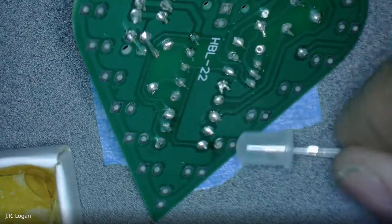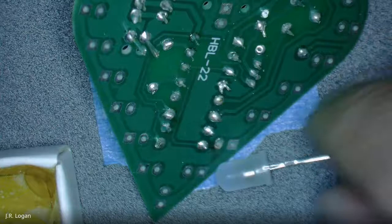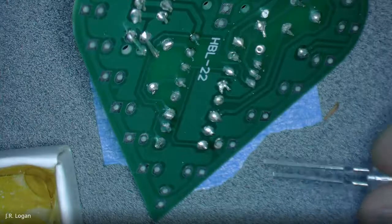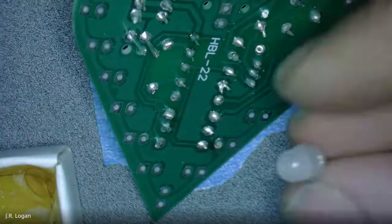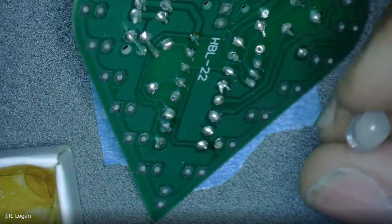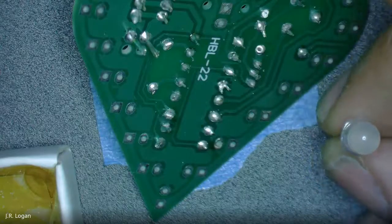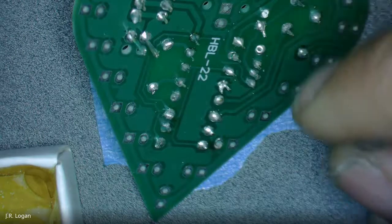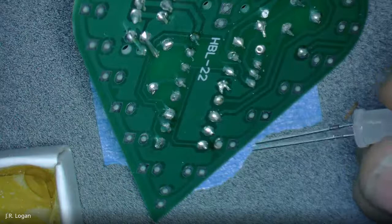Because they are diodes at the heart of what they are, they only work one way. And so, again, you'll see that convention where you have two legs, one leg being shorter. As an additional indicator on LEDs, it's a bit hard to tell, it's a lot easier on some other ones, but there is a flat surface. It's right on that side. So one side is rounded most of the way around, and then there's one side that's kind of cut off. That cut off side should correspond with the short leg, and it indicates that that is the negative side.